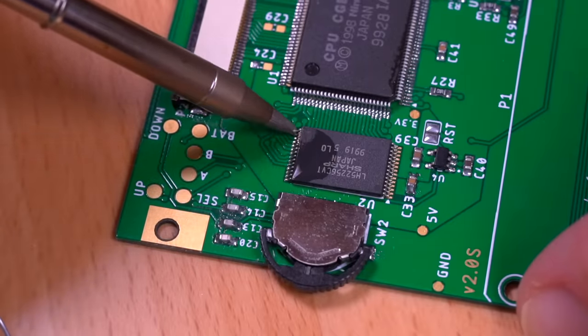If you do plan to go the AAA battery route, I definitely recommend installing a battery indicator LED, which I unfortunately didn't install in mine, because I did have the Game Boy die on me without warning while playing Pokemon Crystal for an extended period of time. While I like using AAAs, since they're super easy to swap in and out, I can see a LiPo battery being a better approach when using this build.